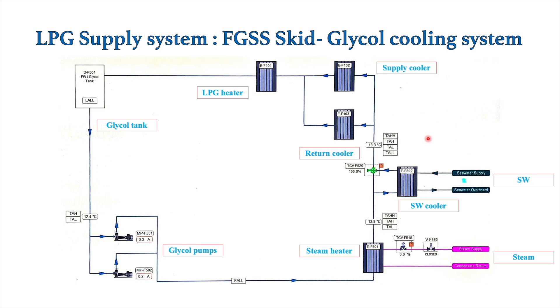If the LPG temperature is below the pour point of the main engine system oils, the system oil — which is present in small amounts in the return LPG coming from the engine — will get accumulated on the pipes, basically solidifying and blocking the piping system. As the pressures on these pipes are around 50 bar, there is a risk the pipes can get damaged and the whole FGSS kit can also get damaged. For that purpose we have to heat up this LPG before it is supplied to the HP pumps.